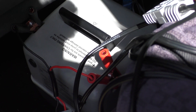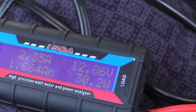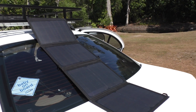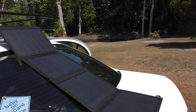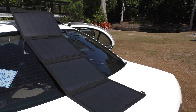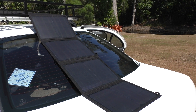It's the Weco Wraps 44 amp hour AGM battery hooked onto the terminals. Just seeing if this will keep up with a 50 litre fridge, this small panel putting out a couple amps. The best amperage I've had out of it is around midday laying flat on the ground as it's getting direct sun at the right angle. I found they work pretty good if you just get them flat on the ground — you can muck around trying to angle them a bit more but the difference isn't massive.